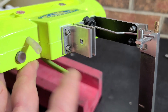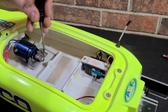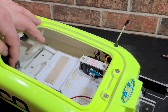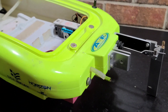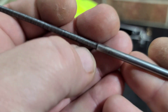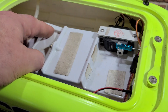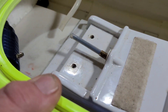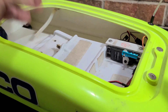You'll need to pull your strut off so you can get to your teflon liner from both ends. Pull the motor out so you have accessibility from the forward and aft section of the boat. The most simple method of getting your teflon liner out is putting your cable — if you're running a 0.150 or 3/16th cable — push that 3/16th stub shaft in there and a lot of times it'll push your teflon liner right out. Just use your cable with the stub shaft.